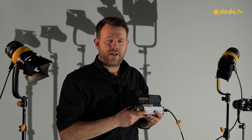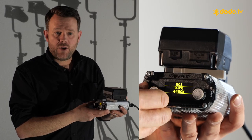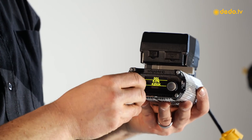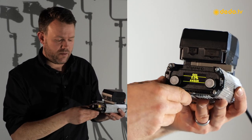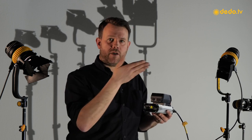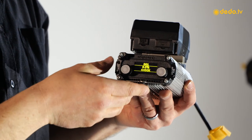One of the requests we implemented in the latest firmware was improving the accuracy of the bi-color units when changing color temperature. Originally we thought for the main use case, you'd set your color temperature to a certain level, look visually and if it's okay, just leave it — you'd never look at the screen. But today with LEDs, customers want the exact value and the ability to repeat it. So we decided to improve it as best we can, taking into account we're still using mono or bi-color LEDs which have a binning — meaning it's a range of color temperature. So we agreed to build an average level.